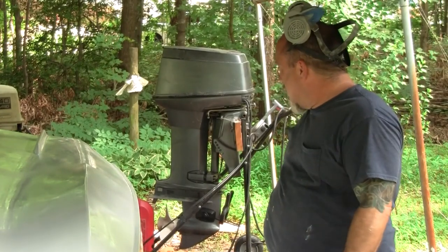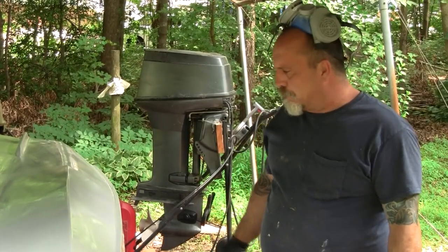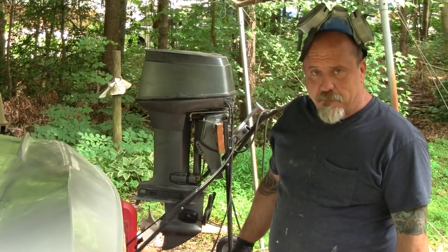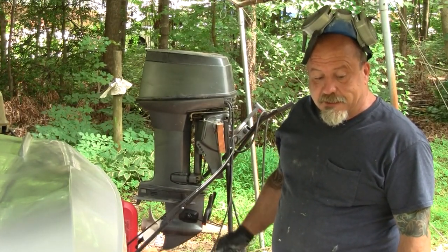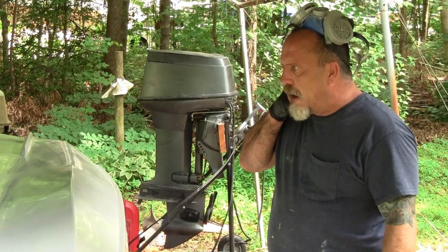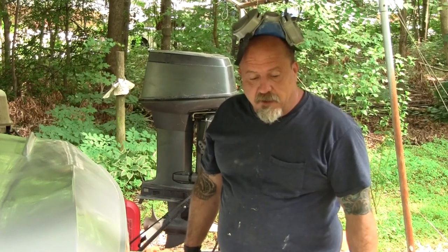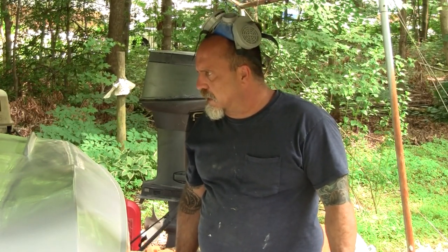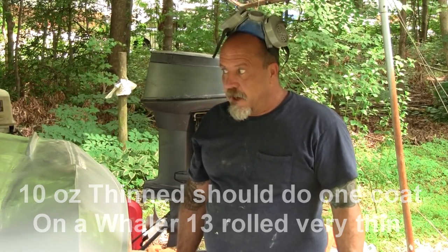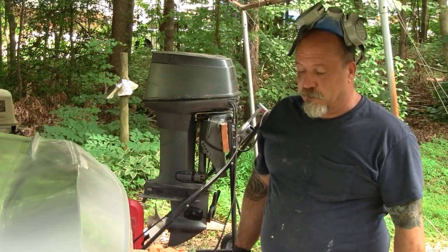That's the first coat and it's looking good so far. Some places have a gloss, some don't. I'm going to sand with 320 before the second coat, give it a day or two to cure. The first batch I mixed up was six ounces - four of paint and two of hardener - and did the transom and half the bow. The second batch I did three ounces of paint, one and a half of hardener, and about 0.8 of thinner. I just ran out as I finished, so that was perfect.